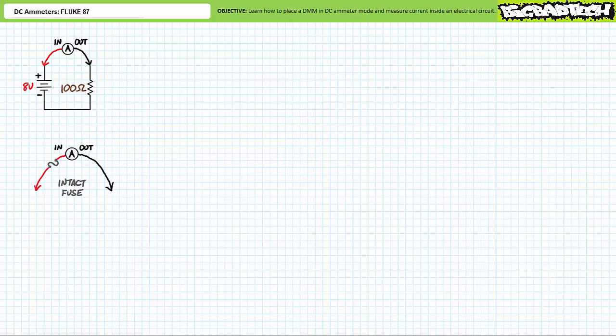A first defense is to deploy the ammeter properly by using the function, leads, range, and placement checklist. If you use the ammeter properly, this won't ever happen. As a backup defense, the fuse is there to rupture in the event you screw it up. Fuses are inexpensive, sacrificial elements designed to blow before anything else more expensive does.